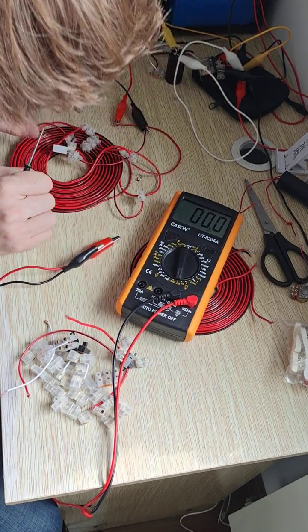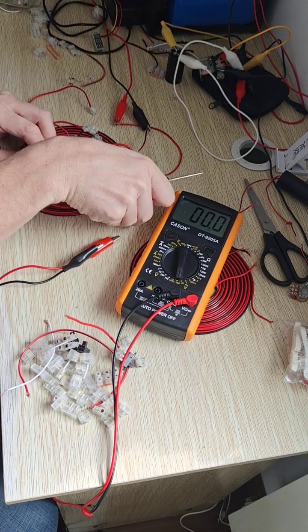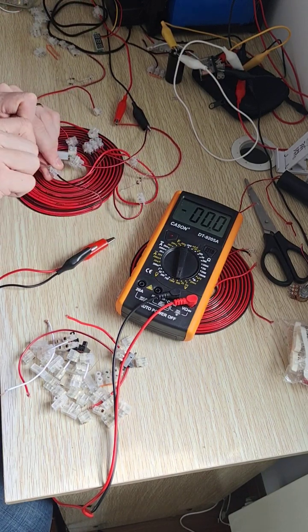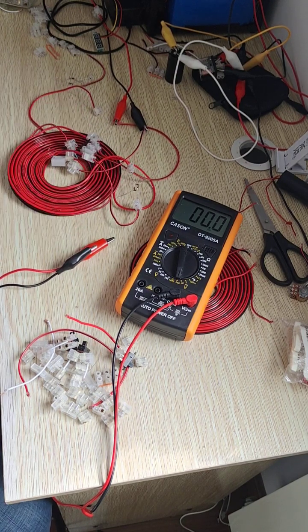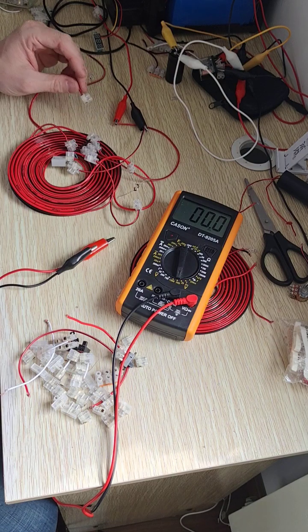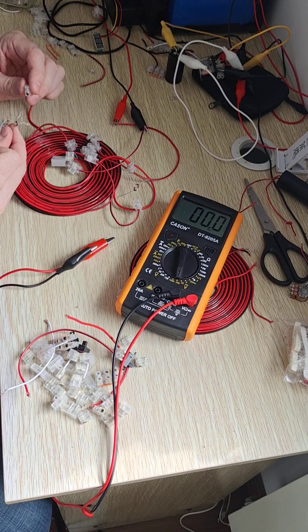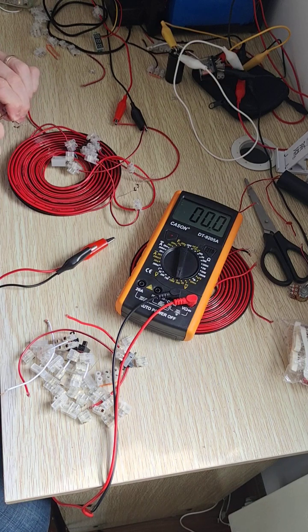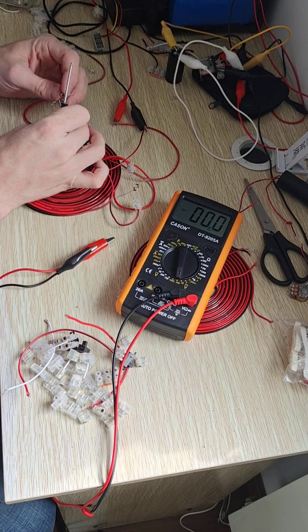So now the bottom coil is upside down, and I'm going to connect the center tap again for the bottom coil. Double check, good. But if you do the opposites like that, what might actually happen is they might just cancel each other out because they're opposite waveforms. They're out of phase by maybe 180 degrees, and so you end up with nothing coming out of them, which is interesting. So put the rectifier back on to the bottom coil.